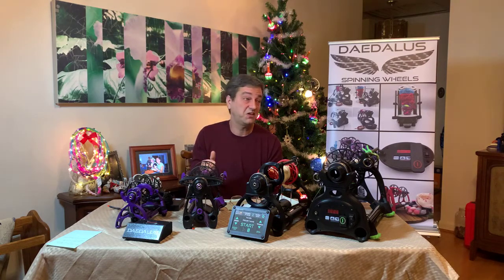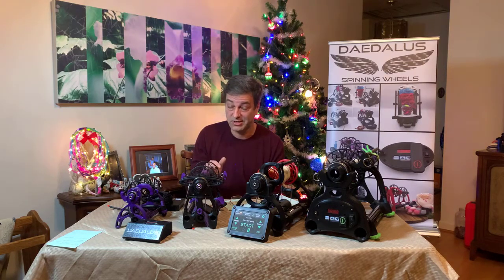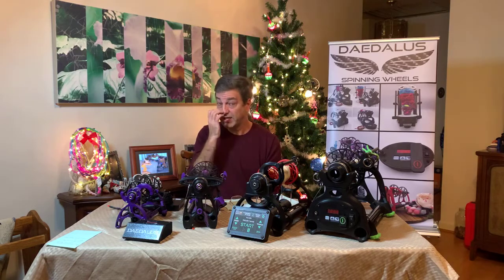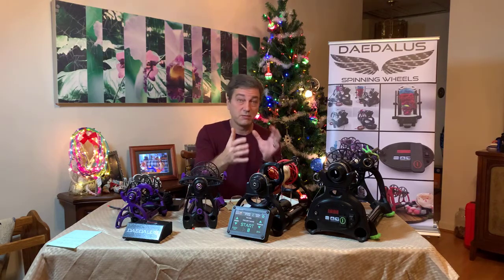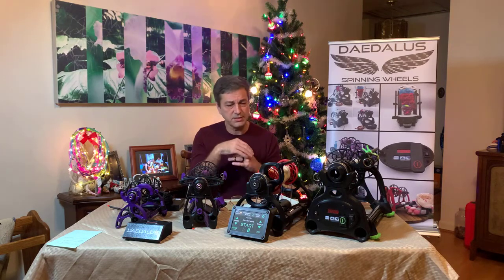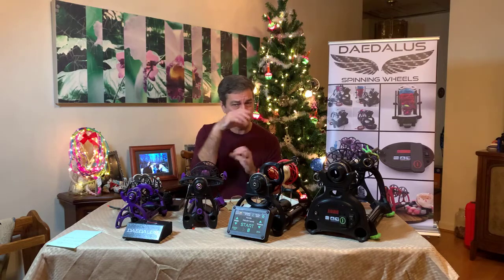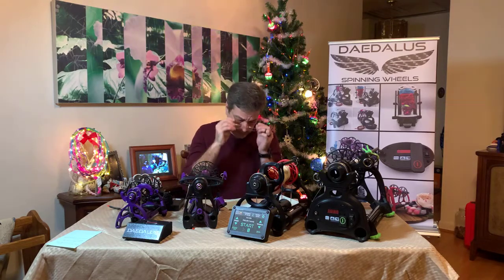It's getting thin. It got stretched. It doesn't work anymore. Nothing. I've made 1,500 drive belts, and I've had none wear out. So it's a great system. So we're using that on both sides with the Raven. So it's not a slip thing. It's not a tension belt. The bobbin is actually driven with a motor, just like the flyer is driven with a motor. Moving on.